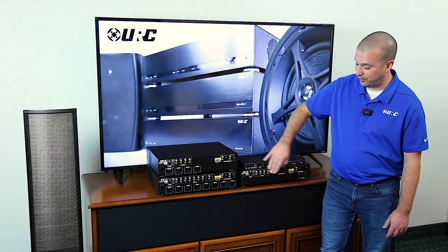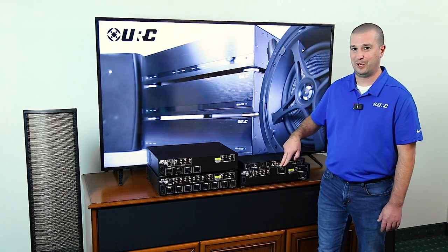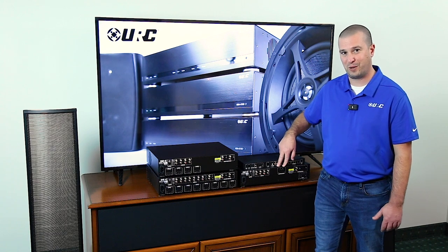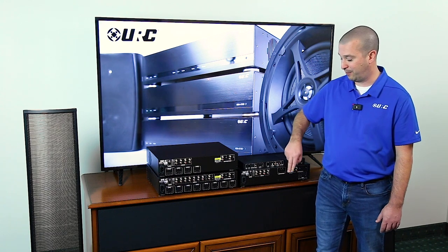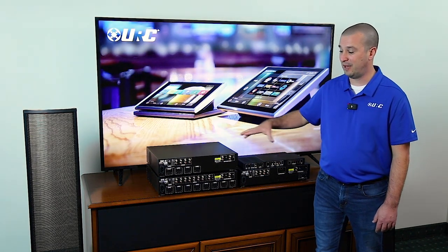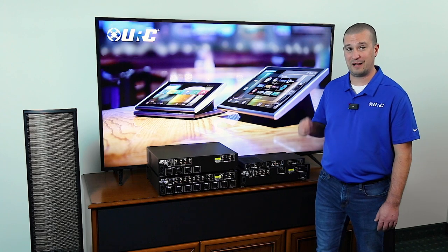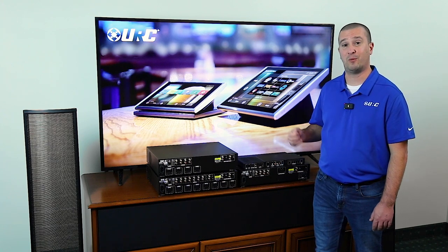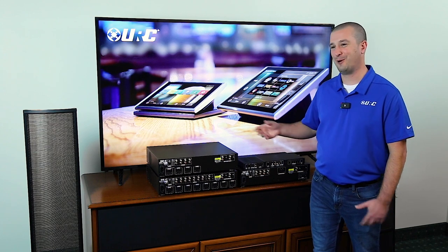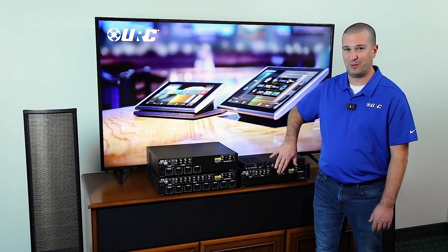So much like the other pieces, we have our audio inputs. This also happens to have a balanced input, which is very flexible. I can use it for say like a Touch Tunes jukebox in a bar restaurant. I can run balanced in, or this can also be two microphones. And because we have full DSP, we can also use that for ducking. So I can have that mic as a talkover for ducking or for paging to page out through. You know, you can call the kids for dinner or call out the Smith party of two, your table's ready, etc. All from that built in.